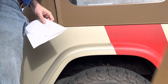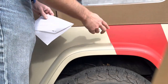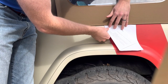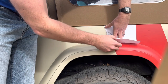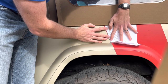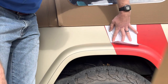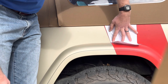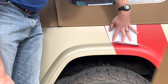On the back side of the stripe it's even easier — all you have to do is once you've measured out the front side, measure the 14 inches width that the stripe is supposed to be, and then as we line that up on the tub you don't even have to look down it like a gun sight. You can just put the tape at the top and bottom, and you can see on mine that even using a laser level I ended up with a slightly different angle on the back side. So like I said it was a little bit more cumbersome to use than just smacking a piece of paper up against the tub to see how things work out.